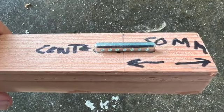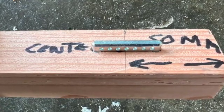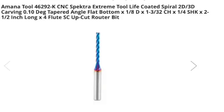After you've cut the two holes, you just slide the Lok-Dowel in place and tap it in. This is the bit that I use in order to create the two 5mm, 21mm deep holes, 32mm apart, to hold the Lok-Dowel.